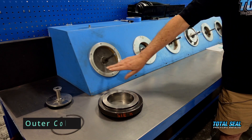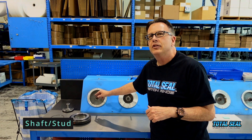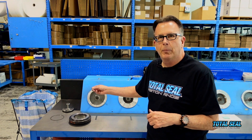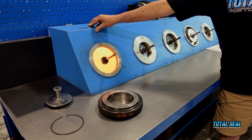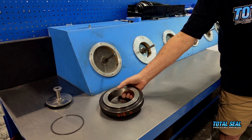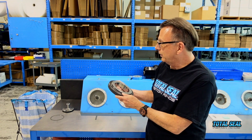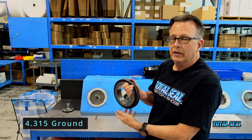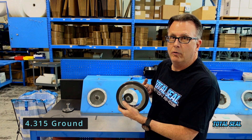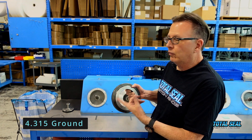Here's the basics of how it works. We've got the outer collar, a piece of plexiglass, and the shaft or stud sticking up that's going to allow us to pull and square that ring up. It's got a light in it. We've got, in this particular one, a mercury master gauge. This particular one's four inch 315. These are ground — they're not honed — they're certified to the millionth, truly a round gauge.